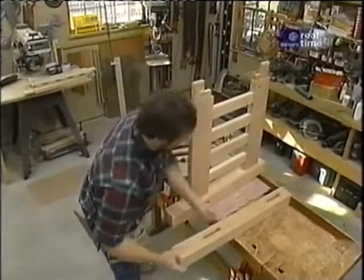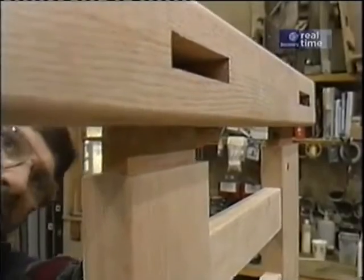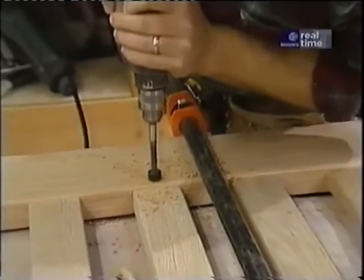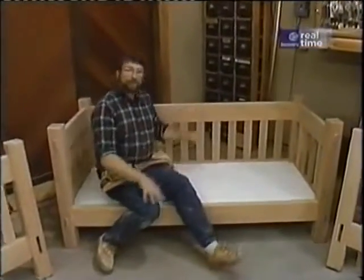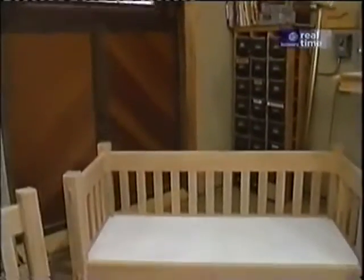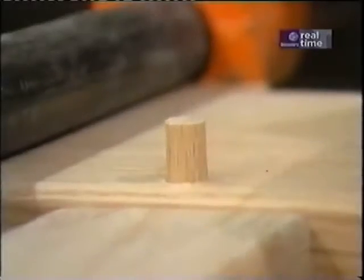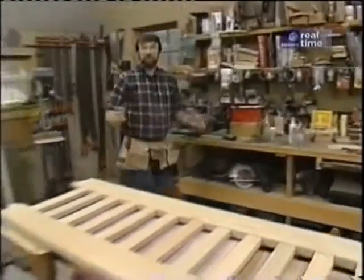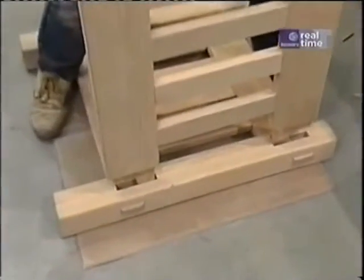I almost don't need any glue on those joints — they're that tight. I'm going to let the slats float, except for a couple — the middle two along the back — because as you sit on the couch, weight will be transferred to the bottom rail and I don't want it to separate, so I'll just pin it with a couple dowels. Moving quickly before the glue dries on all these tenons, I'm going to put this whole assembly together, clamp it, and pin it with some more dowels.